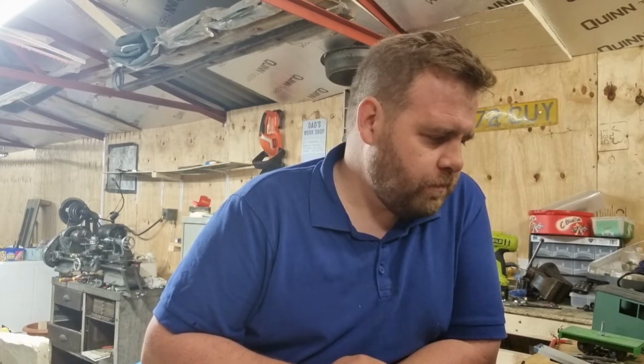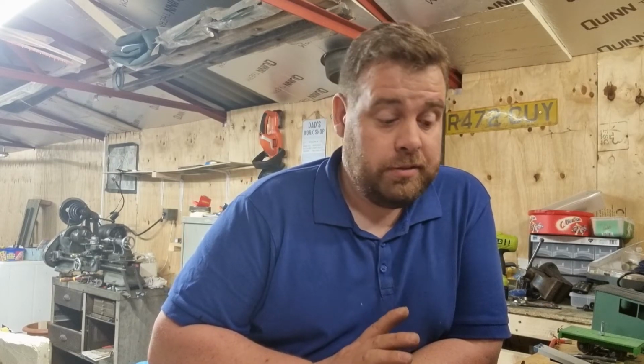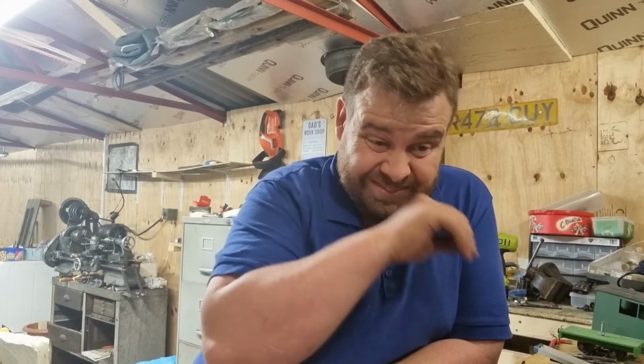I know it's been a couple of weeks since I did a video, maybe about 3 weeks ago now. I got quite a bit further on the 5-inch gauge electric loco 040. Motors are now mounted, wheels are in, the two sets of wheels are glued onto the shafts, and it's all mounted. Really, it's ready to go for a test run. I've got the PWM speed controller all mounted on it. Even the couplers mounted as well, so it's all ready to go for a test run.